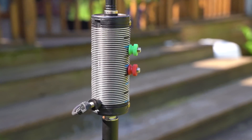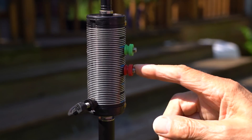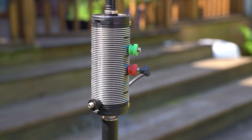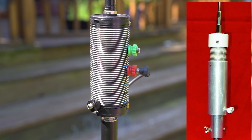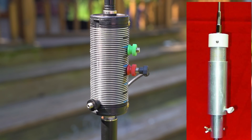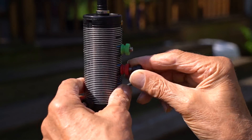So let's now take a look at the Buddy Stick. This is the coil, the resonator coil, and it's got these tap-ins on it. The reason I like these tap-ins is because they are fixed — you can set them up and they are repeatable. If you use something like the manual tuning screwdriver system, you can set it up but it's very difficult to position it back to a particular frequency. There's no real indication. The beauty of the Buddy Stick is it is dead accurate, and therefore you know that your setting made in the garden is exactly the same setting you're choosing in the field.